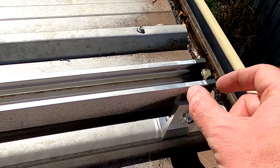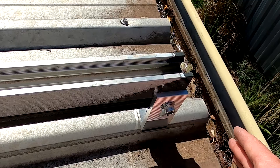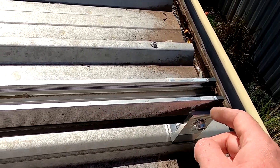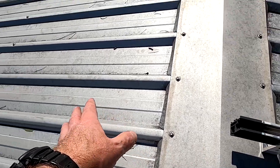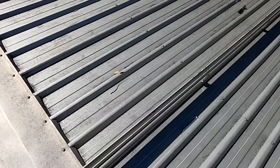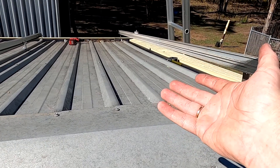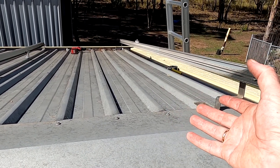The solar panel goes to about here and then we have an end clamp. I want to give the water enough time to run off and hit the gutter — I don't want the runoff from the solar panel going over the gutter. That's why I pushed the rail as far up as possible. This doesn't exceed the middle of the roof, so we clearly have space on the other side to extend the whole solar system later when we have more batteries. The only real concern is the height — I like having enough space to get underneath for wiring, measurements, and troubleshooting.